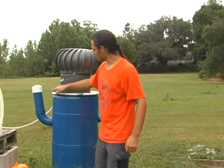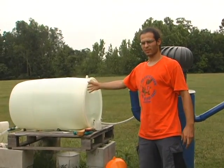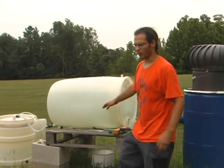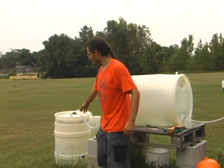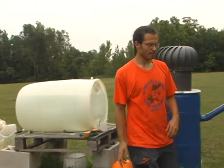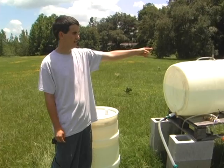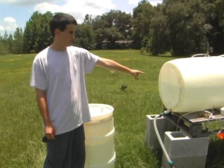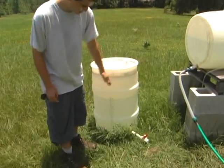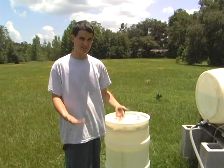There's a hose coming out of the digester that carries the gas into a collection vessel. The gas comes in, displaces water, and we have a metering vessel that lets us see how much gas we produce per feeding or per day. When gas fills the barrel from the digester, it displaces water in the gas collector and pushes it into a second barrel — you can measure how much gas has been made by how much water has been displaced. The volumes are equal.